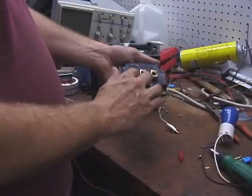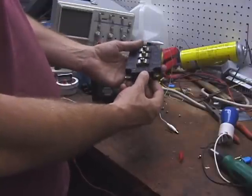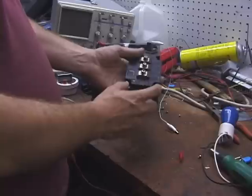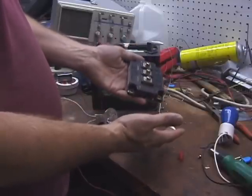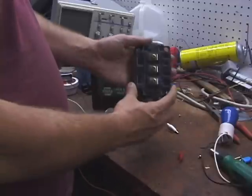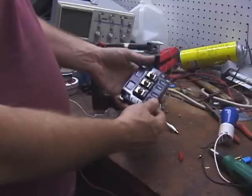This is actually designed to drive an H-bridge. Over here there are some small spade connectors — four of them: two emitters and two gates. We're going to be interested in the gates. This is how a double package works. There are even six-pack bricks, which provide a complete DC to three-phase conversion in a single IGBT brick, but once you figure out how to do singles and duals, you'll know what to do with a six-pack as well.